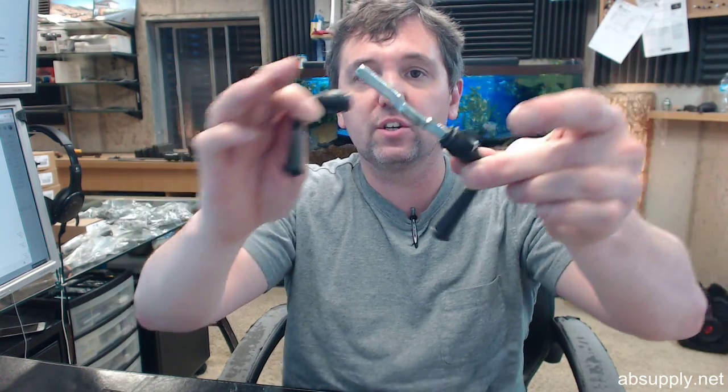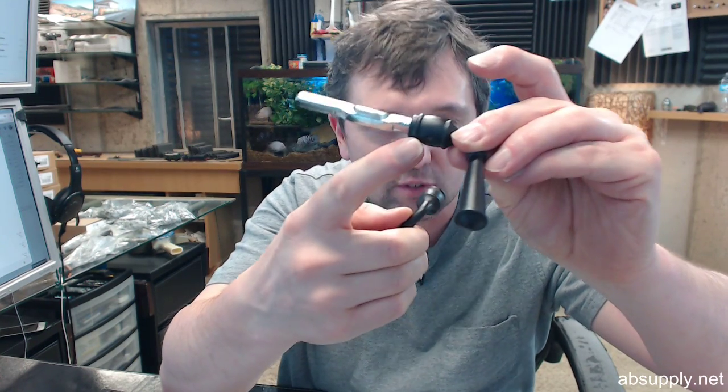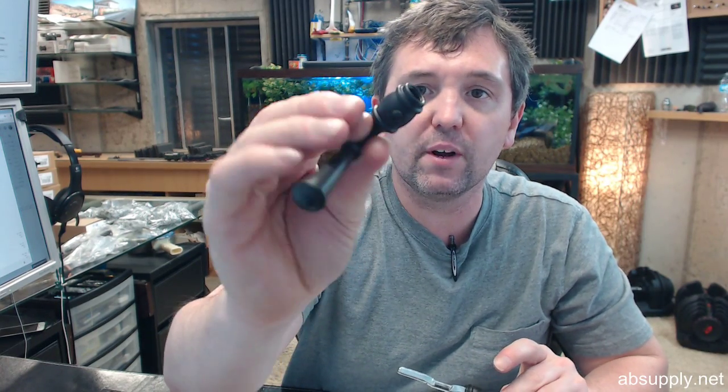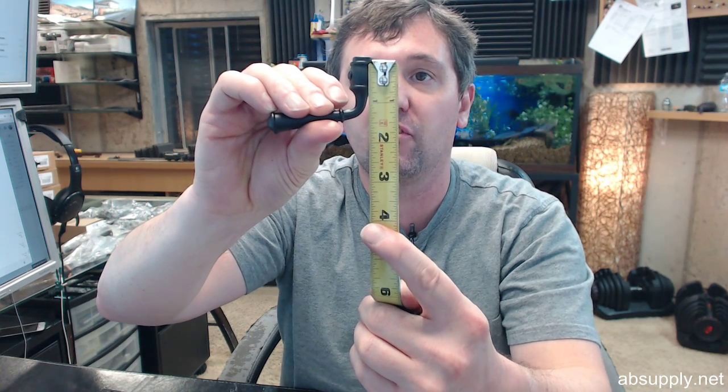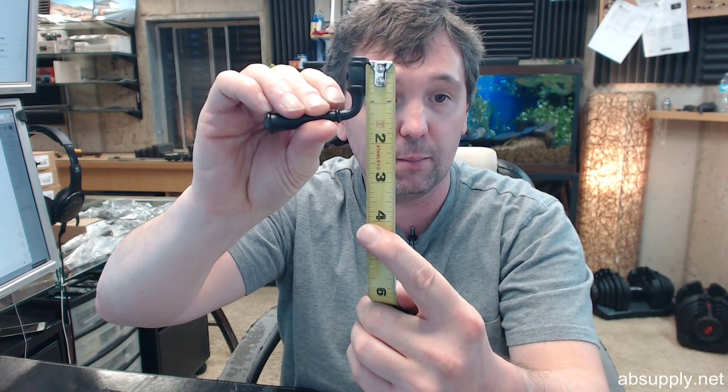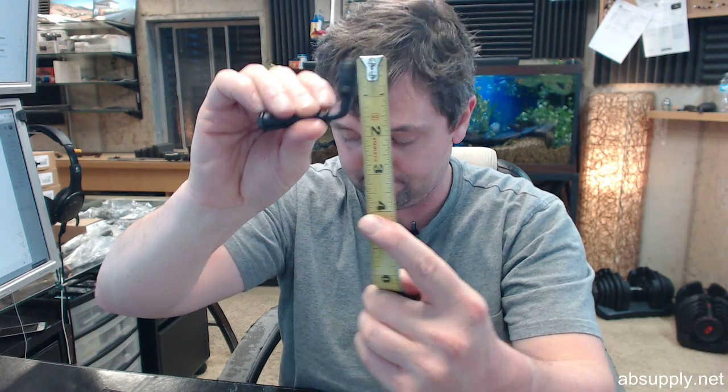Now the levers, very nice quality fit and finish on the levers. Here is your, well, it really doesn't matter, your interior or your exterior. That's the spindle. I saw no need to remove that. There's a set screw that holds that in, and of course on the other stem there. Give you an idea of what the lever measures, and overall, it's about 2 9/16. Projection of that from the face of the trim is going to be overall about 1 5/8 inches.